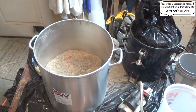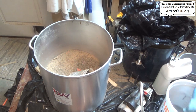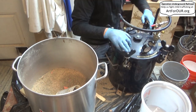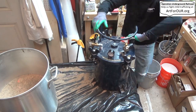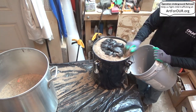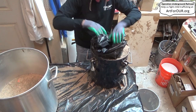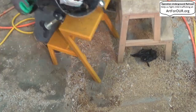This is all a fabulous plan. The vacuum chamber is really important. What I'm discovering is that when you put your wood project in the vacuum chamber and you decrease the pressure, the air in the wood is displaced, resin seeps into the wood, and it totally solves the problem of streaming air bubbles that come out of the wood. That's something I fought for a long time. Yes, you can treat the wood beforehand, but you better have it perfect. What you're saying when you treat it like that is that you're going to seal every microscopic hole.